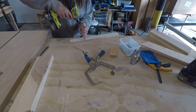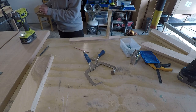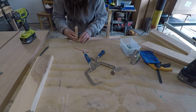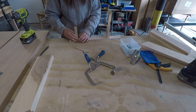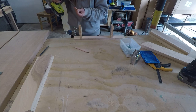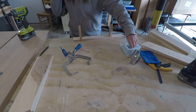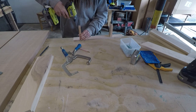This jig is just some scraps of plywood, but you could also use scraps of anything you have lying around in your shop. I just attached two pieces to the top of a base piece at the width needed for the base of my X, and that ensured that when I put everything together, both legs were exactly the same.